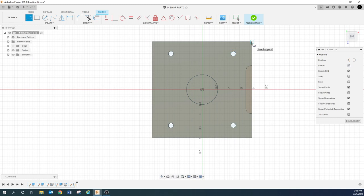And I'm going to draw a line just like that. Now we're going to keep it really simple. And I'm going to dimension this line. You can either dimension it this way, so you can say I want this at 6 degrees, or if you click this point, you can dimension it in a more direct measurement way. You can say, I want that surface at 400, whatever.